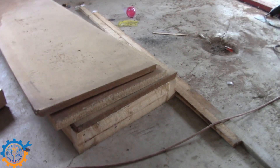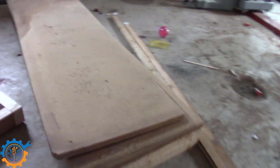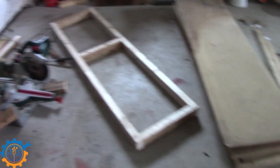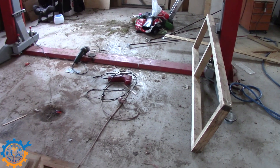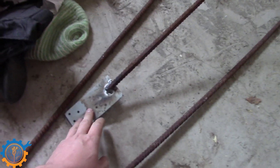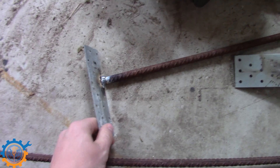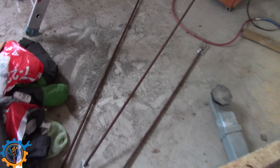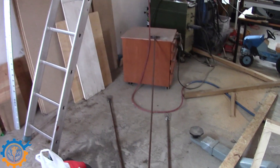Underneath you have the thicker two-by-four section, and the shelves themselves are made out of two-by-three. On top of this I will be having this rather thick material — about 26 millimeters. There will be roughly 200 kilos of batteries on each shelf, so that should not be a problem to hold everything up. I made three shelf frames, one with a flat end and one with a bend, and each one should easily hold 200 kilos since they are sharing the load across all three shelves.